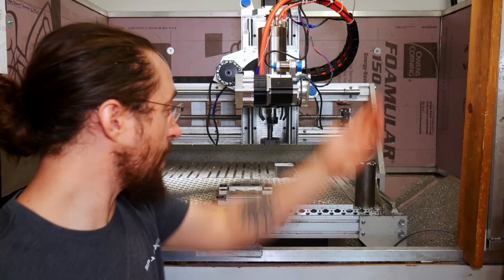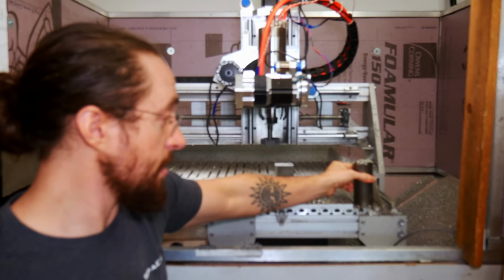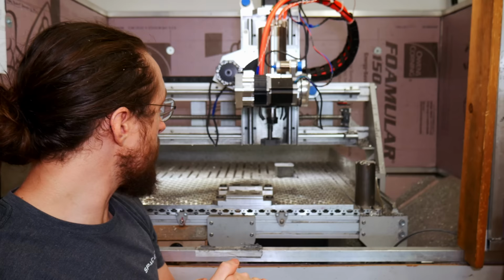And that works, and I did a bunch of hammerheads that I'm working on. This is steel. I was cutting a bunch of steel on this machine. It did work for the most part. I had a few crashes, which this is one of them. But it works, and so I had to go do a G54, a G55. Actually, I was just doing two offset cuts.